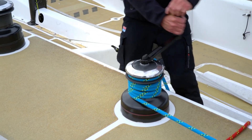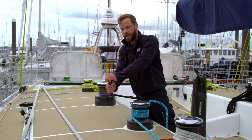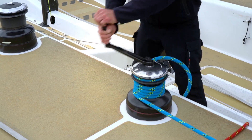You're going to go in the difficult direction first, remembering to use your body weight, not the strength in your arms, to winch in as much as you can. You're then going to stop. If you still need to bring in further on the line, turn the handle the opposite way and you've dropped down a gear.